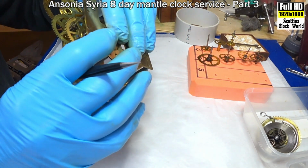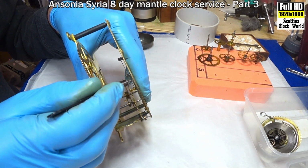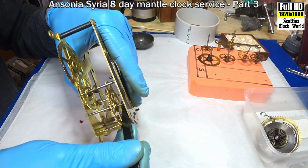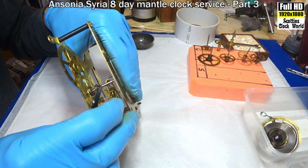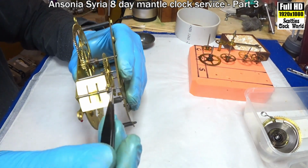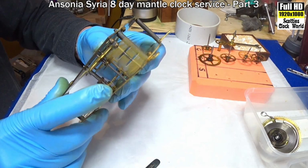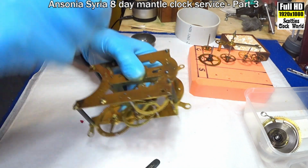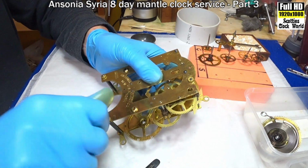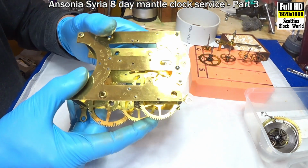Now we'll put the pivots into the bushes. First wheel. Second wheel's down there. Got that one. Warning wheel, and the fly. Spin it to make sure we're right. Nut on the top, tighten the other two. Hand tight's all we need. See what we got.